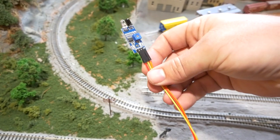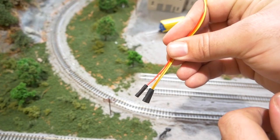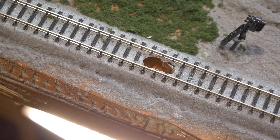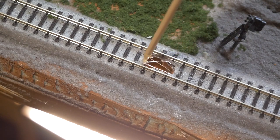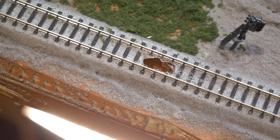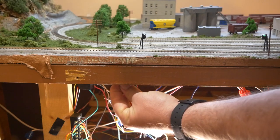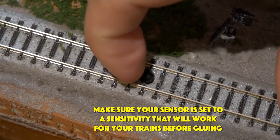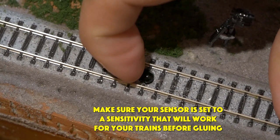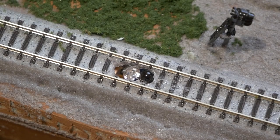We have a nice lead, and I'm just using jumper wires like we use for prototyping. I'm going to cut these ends off and extend them to longer wires so I can hook them up to the Arduino. Before we attach the infrared sensor, I'm going to put a little bit of super glue all around the edge so that it sticks quickly and holds in place — this is the dollar store super glue. We'll thread this up through the hole, and then pop it out just barely to make sure the train will have clearance, and hold it up against one side until it has a good bond. It does take about 24 hours for this glue to fully dry, so we'll leave this overnight to make sure it gets a good bond.